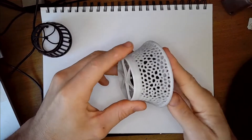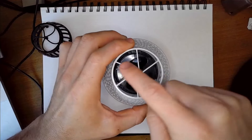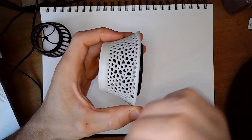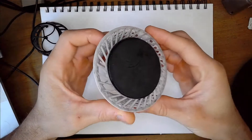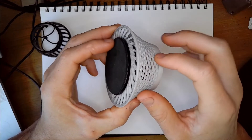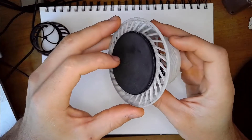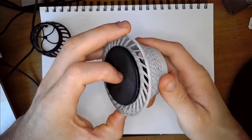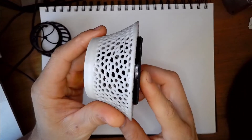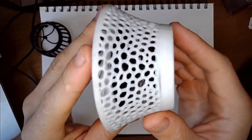Let's talk about this design - it fits perfect, though I could make a tiny adjustment to make it fit a little more snug. The front where the water exits is a little too large; I want it slightly tighter, and the overall design could be a bit smaller and more compact. One of the best features is the small Voronoi structure that protects anemones and fish from entering the impeller zone, while water can flow around almost freely to the back of the pump where angular grates keep anything else from entering. This will have very low suction because it's furthest from the impeller.